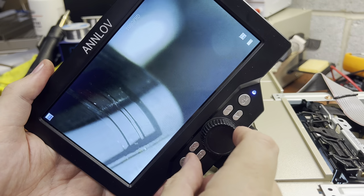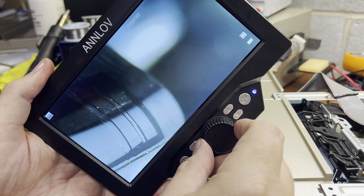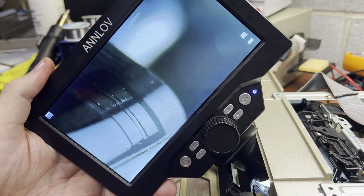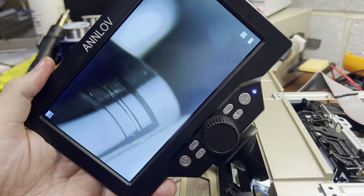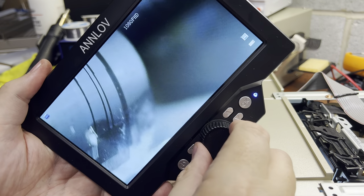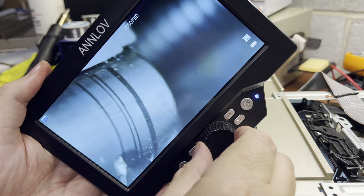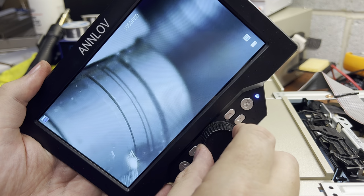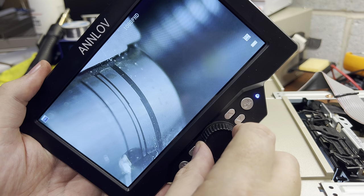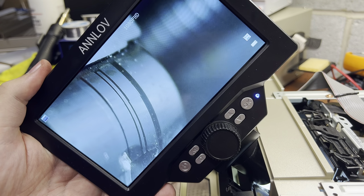And here guys, I'm looking at the head and as you may see, it's like new. There is zero wear. And I checked that after the first amplification, before the Dolby chip, on the playback amplifier, we already have a significant loss of the high frequencies. And here is the playback head, you may see a gap right here. It looks like new, really. I'm not sure what's going on. It was sitting for too long, I believe. Okay, let me think what else I can do with this guy.